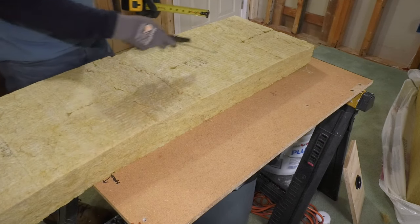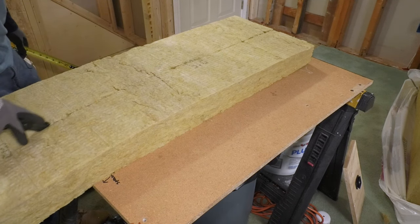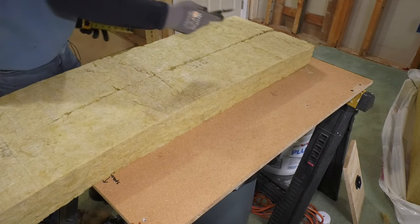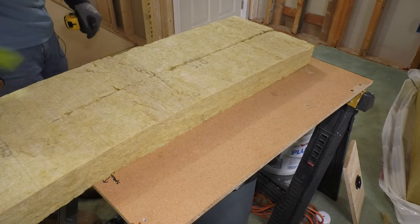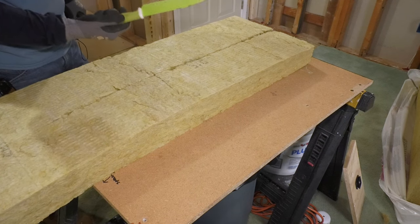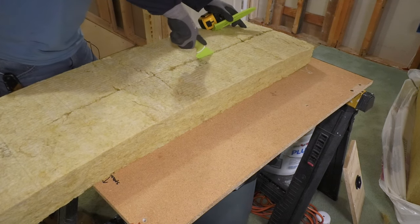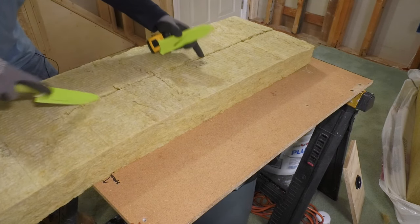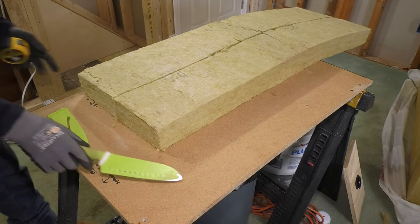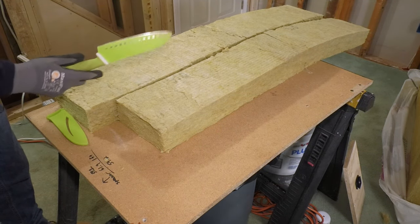You can cut this with a utility knife, but that could take you a while — you just mark it and go back down. The cut's pretty easy, but to save time, what I like to do is use an old kitchen knife. Somebody commented and said 'is that a Ryobi kitchen knife?' — no, but that's pretty funny. I have it nice and sharp so I can just drop it in here, put some pressure on it, make one slice. That works way better. Your piece is ripped. Highly recommend an old kitchen knife — definitely don't put this back in the drawer when you're done with it.